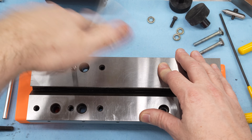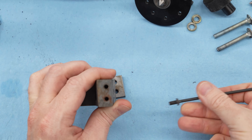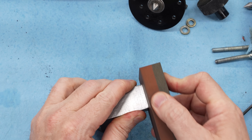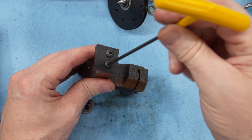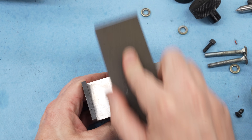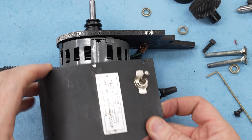We're going to tap through all these holes — these are 5/16-18 holes in the top and they're there to mount the punch grinder if you want to use that option. Back on the tail stock support, there is quite a bit of grit that looks like caked-on grinding dust, but I couldn't get any of it off even with a steel brush, so we'll leave it. Stoning all of the flat surfaces before we put this back together, and I found another screw to put in there too so we have both screws again. The headstock is the same — you can get a better view of the lever mechanism. I'll use the square edge on the precision ground stone to get that face smooth.